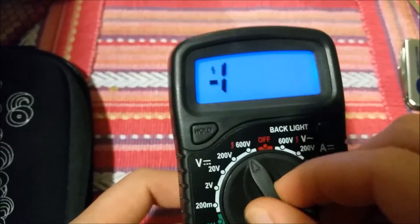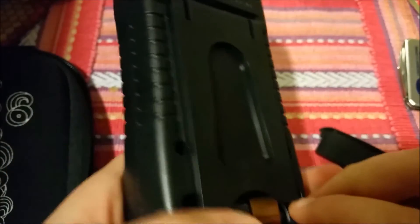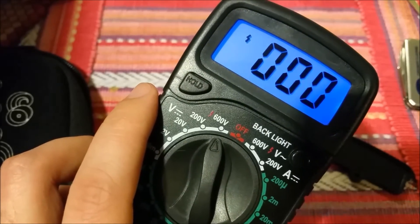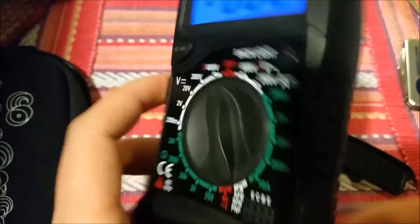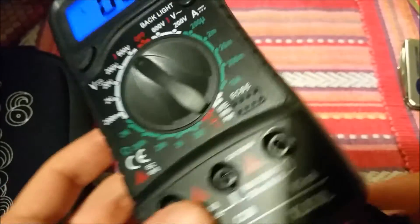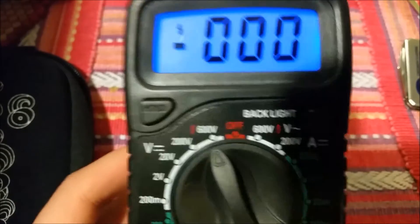Let's see if it works. Booyah! There you go. The button does nothing now, until we pull this. If we pull this, you can see it goes fully bright, and then it'll dim down in a sec. It dims down. I do like that PWM dimming feature actually. And if I put it back in again, it's on permanently at this dim light intensity. This should last quite a while, because as we measured it was about 1.3 milliamps. So it'll probably use a little less than half the battery life compared to if you just had no backlight on ever.